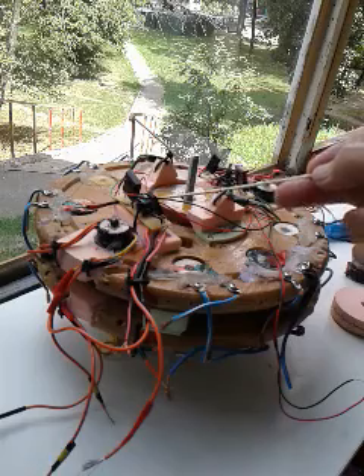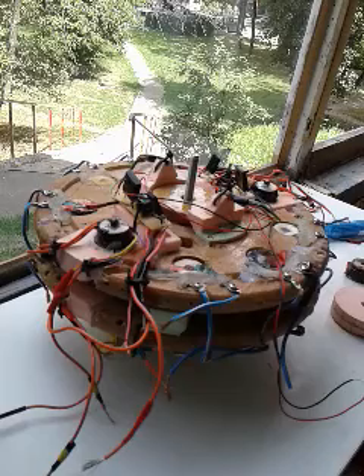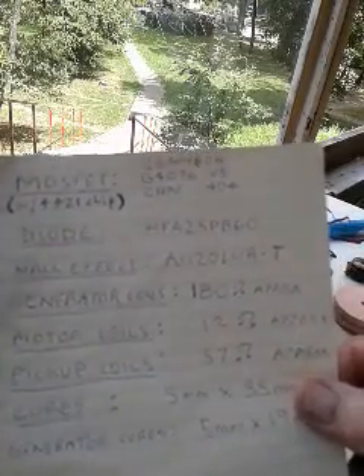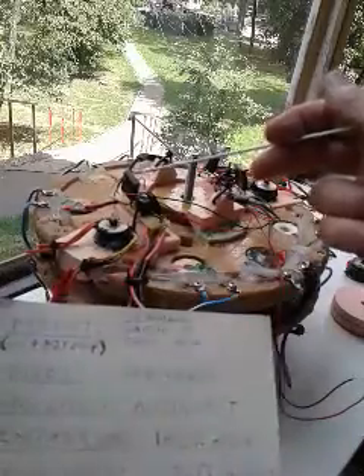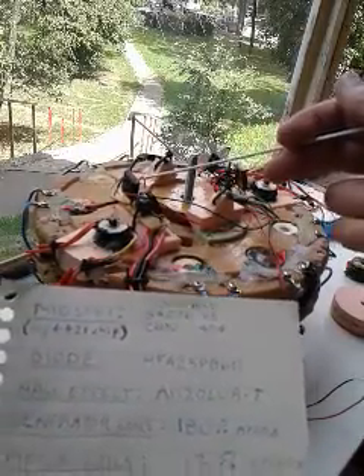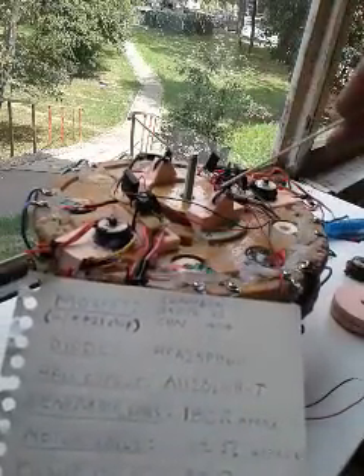It's driven by a MOSFET here, and this coil position is driven by a MOSFET over here. The MOSFET is a G4076 V5 — you can see the numbers on top — and it has a 4421 chip. There's a big diode right here that catches the back EMF recoil flyback spike, and that is an HFA25 PB60. There's a little Hall effect here and another one over here; each MOSFET is triggered by a Hall effect, and that's an A1120 LUAT.